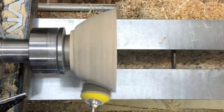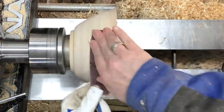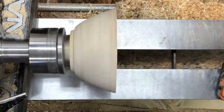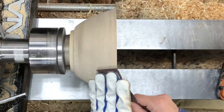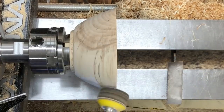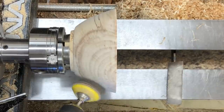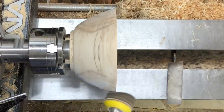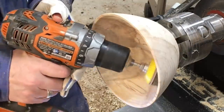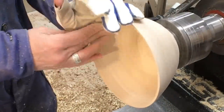I don't really understand why I have so many little marks on the outside of the bowl — I did not see them after I got done shear scraping. I'm not sure if that's a product of pushing on the bevel too hard, not gliding, and creating some friction and burnishing marks. I spent a ridiculously long time sanding this bowl. I did some power sanding with the lathe on, some power sanding with the lathe off, then went back with sandpaper strips. I spent way longer sanding this bowl than I normally do — partially because poplar is pretty soft.